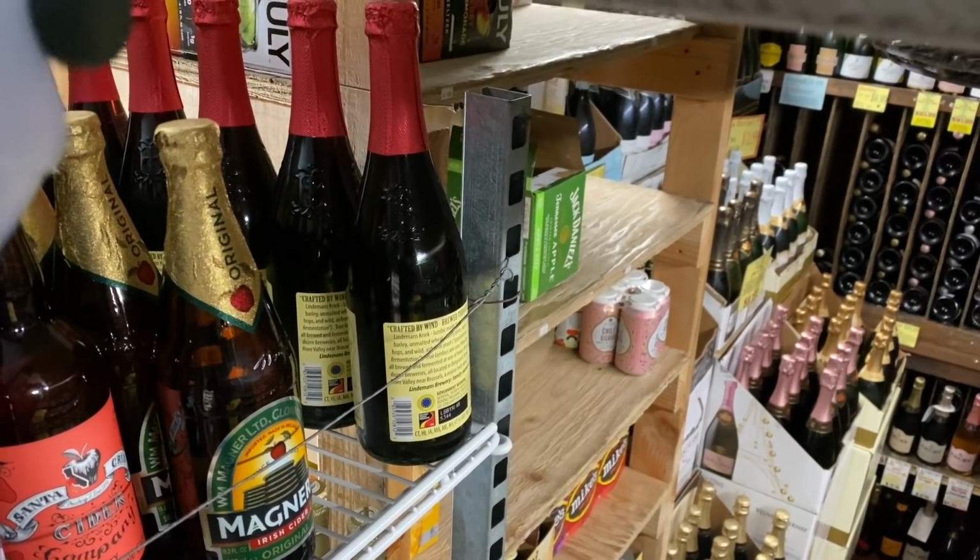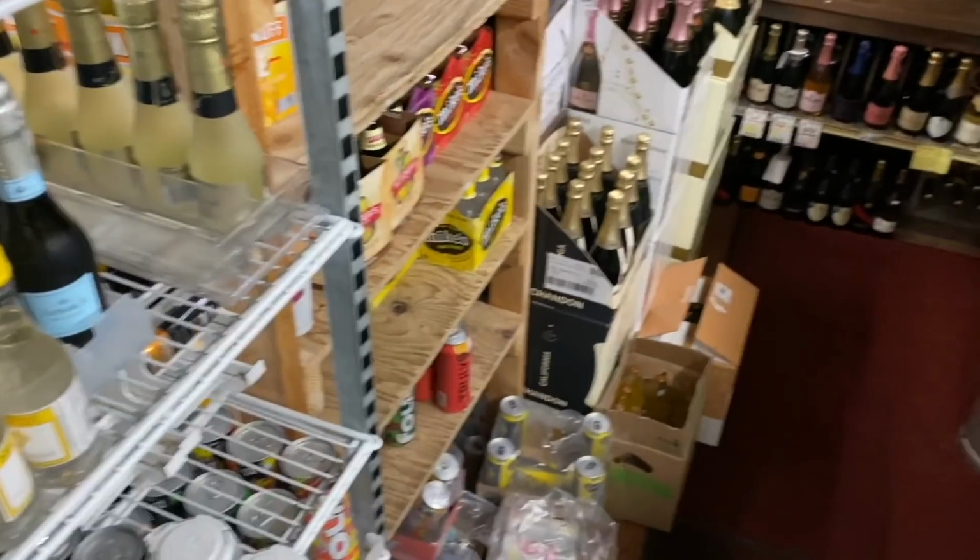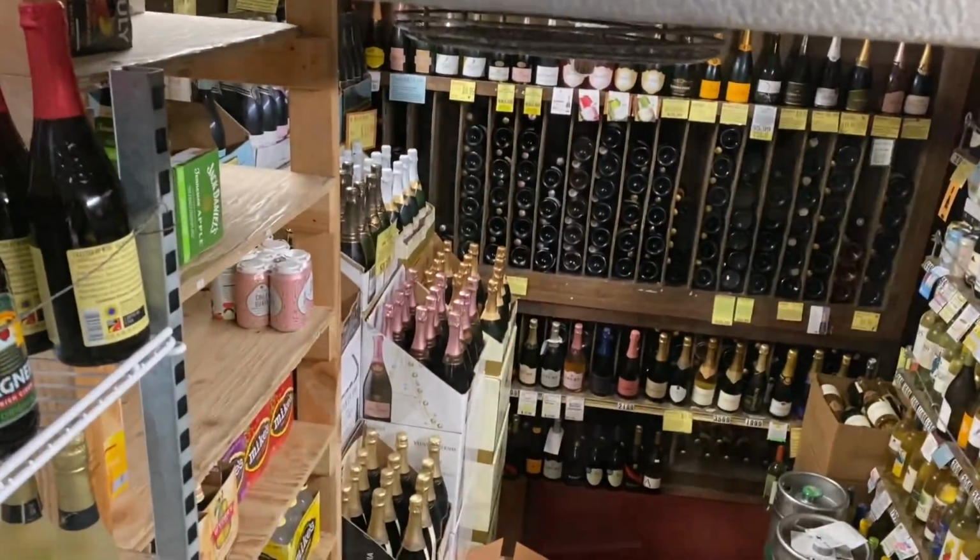Let's get a bunch of soap on here and see what happens. I think I can see it bubbling. Oh yeah. There it is. So I want to see if there's any coming off the bottom or if it's just off the top. It's just that top spot. All right, now we can go pump it down. Get her pumped down, we'll try and fix that.